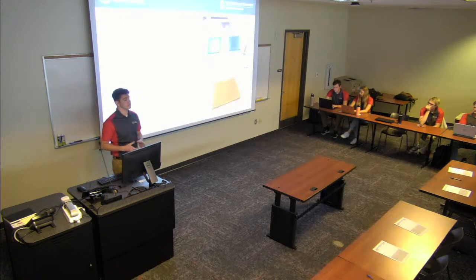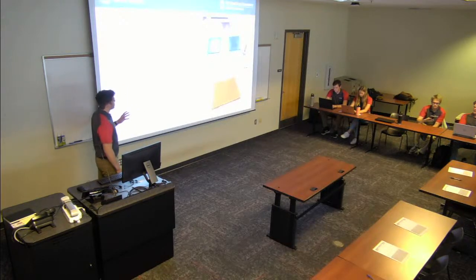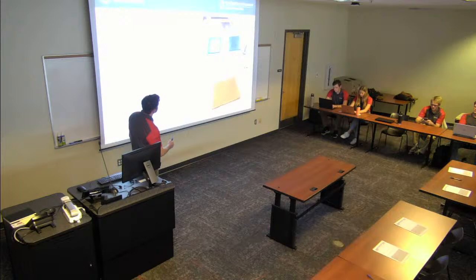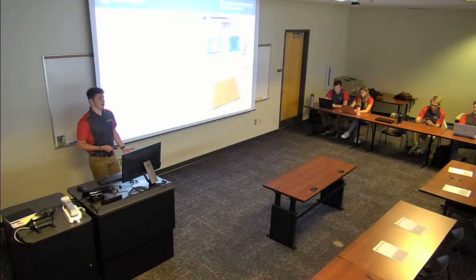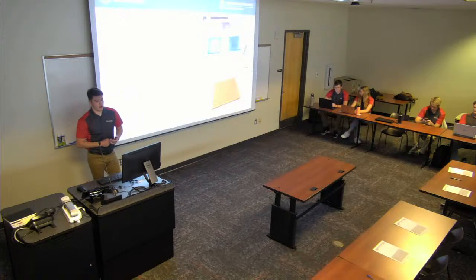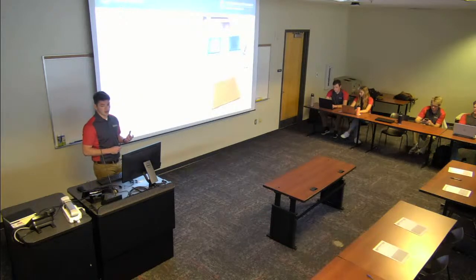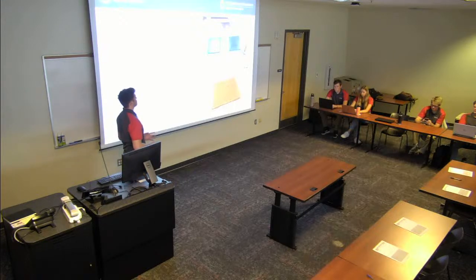But as I said, we're really trying to push data-driven reasoning. And so that brings me to new things we're going to do this year, which are, number one, we're going to lay out parts on aluminum panels. So you can see over here on the right that we did a layup. These are bulkheads, and you can see that it's on an aluminum surface. And so there's a few benefits to that. One of them being that the parts are a lot easier to get off. Those parts just come right off because you can prep the surface very well. Another thing is the surface finish on the side is very smooth. It's almost glossy right off the bat. And then it also helps a lot with our vacuum bagging process, which is what I'll discuss next.